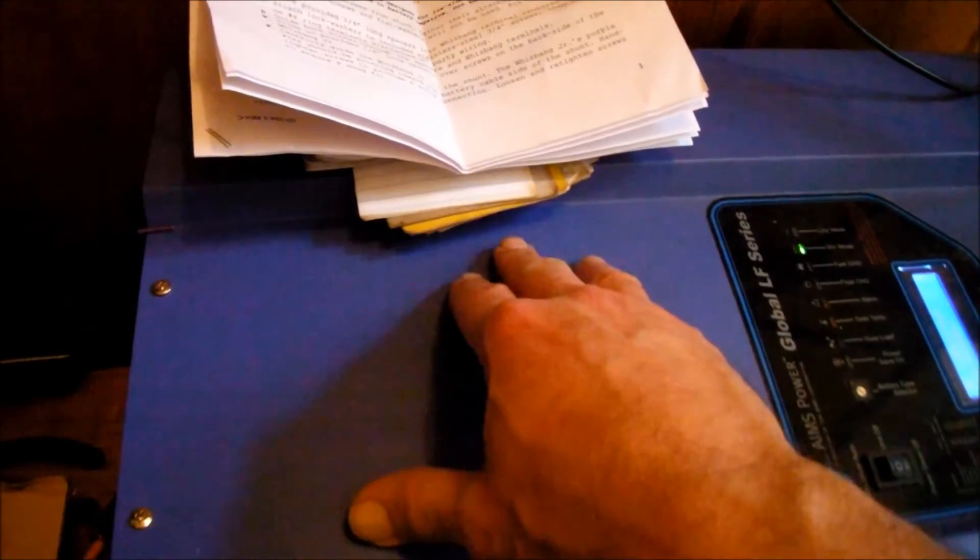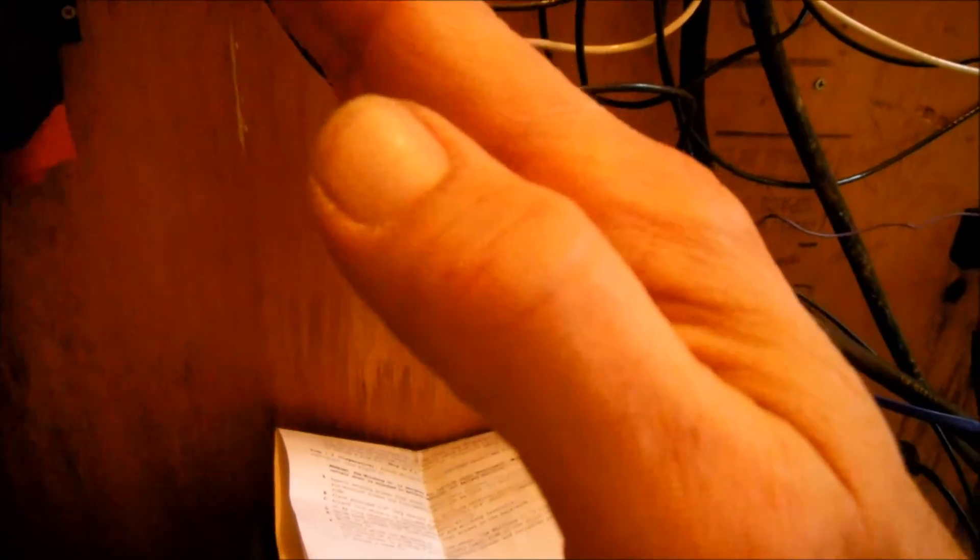So far I'm very, very happy. My memory card got full so I had to start over. Anyway, what I was about to say is I need to change the angle of my solar panels — they're really laid back right now. When I first installed them it was summertime, and it's surprising how different the sun's position is in winter versus summer. The difference is really drastic. I kind of knew it but didn't realize how much.